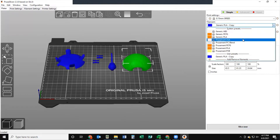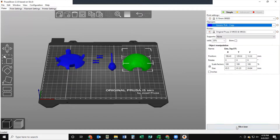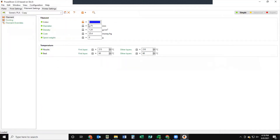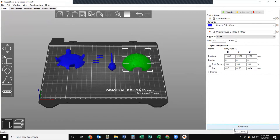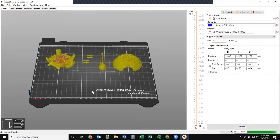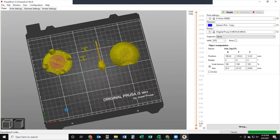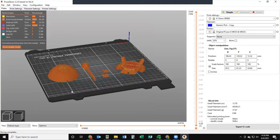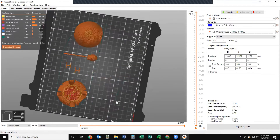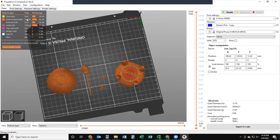We're ready to go ahead and pick the filament - you can pick different ones. I have a generic one set because it's not a specific Prusa one. You can go to the settings and change the color of the filament so you can get a more accurate depiction of what your print is going to look like. I chose blue filament because we have one of those. You can also change the temperatures of the nozzle and the bed while you're there, or you can do it on the printer. I went ahead and sliced it - what this does is take your 3D print model and slice it into a bunch of tiny layers that will eventually build your 3D print. You can still move it around and look at it.